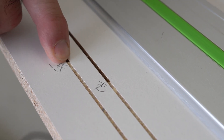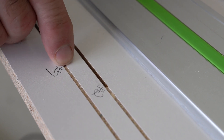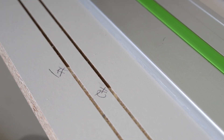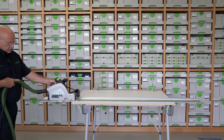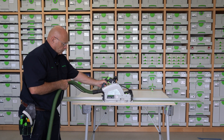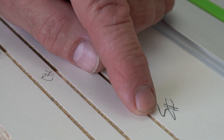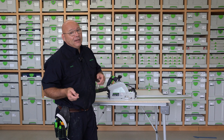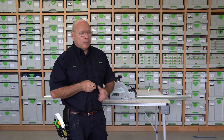This is our first cut and this is our second cut. You can see the difference — I did four clicks to the left. I'm going to try a few more. Third time's the charm! With just a couple moments of time setting up that scoring blade and lining it up with the main blade, your TSV-60 will produce that perfect cut for you every single time going forward.